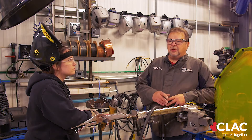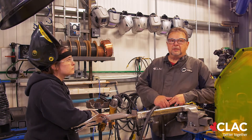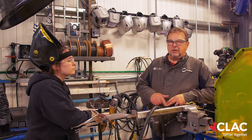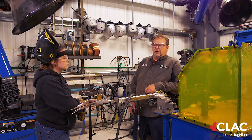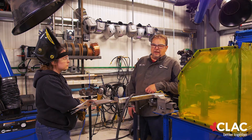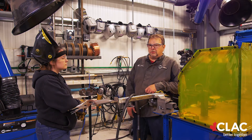The process we're going to be doing today is Fluxcore CWB flat test plate. Believe it or not, the flat plate is the most failed plate on test day. It could be because people take it too nonchalantly, but the biggest problem with Fluxcore is they put in too big of beads on the first pass and they don't get into the root. The key to passing this test is small hot beads. McKenna will be welding at a very high voltage and high amperage, putting in small beads, and then she will move on to weld the plate out completely.